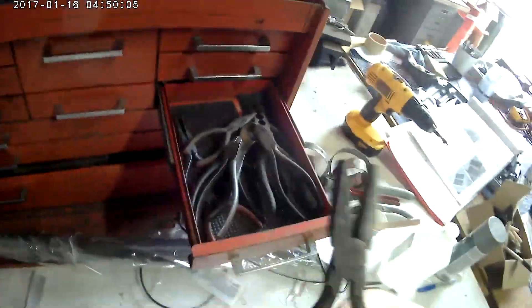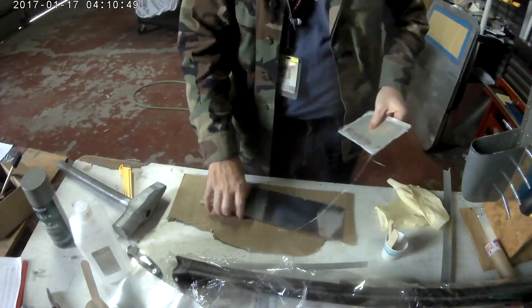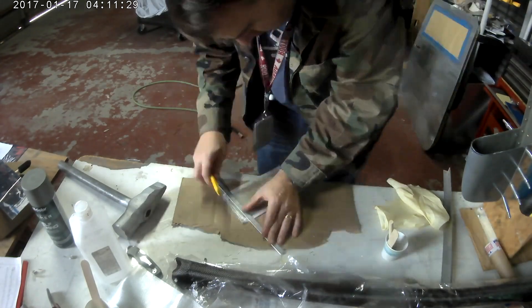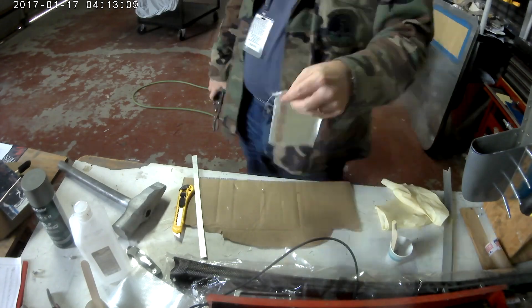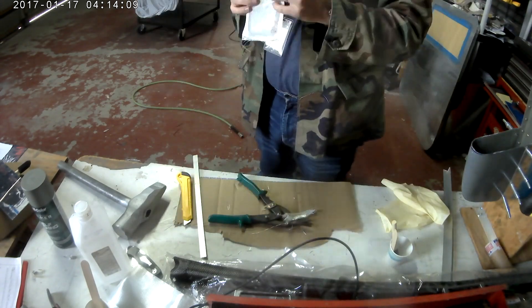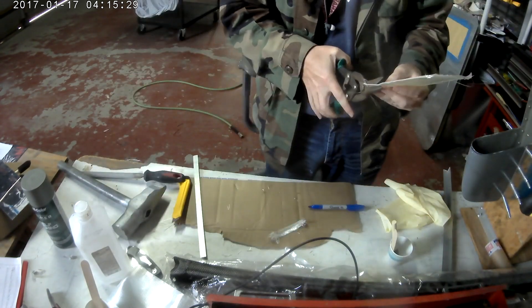For small patch pieces, no problem — you can do that. I'm putting mine on top of aluminum because it just kind of separates right off. If you don't have spare aluminum, you're going to have to do it on some kind of work surface that's waxed, because epoxy likes to bond everything. I've also got cardboard there in case it goes around the fiberglass — I don't want it sticking to my work table because I'll never get it off.